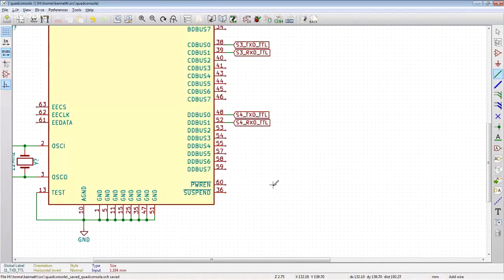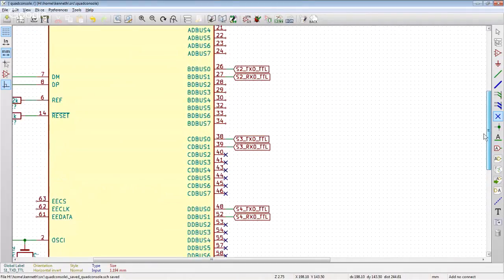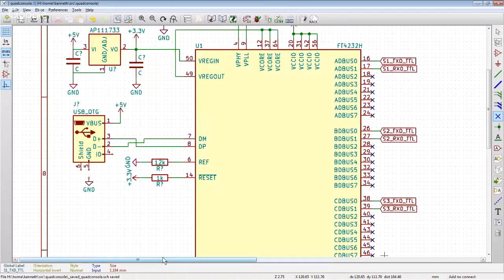So now at this point, we're actually done working our way around, right? Because we're back to grounds. We have duly considered all these other pins here, and we've decided that we don't actually want to attach anything to them. So what we now want to do is come back with the place do not connect flag, and drop that on each one of these pins that we know we aren't going to be using, because that indicates that we haven't forgotten to connect them, and that they really are just not connected. Which is nice, because when you run your electrical rules check, if you legitimately have forgotten to connect something, it'll flag it for you. Granted, because of this stupid 1117 bug, we're never going to get a clean electrical rules check, but a guy can dream.